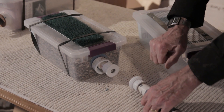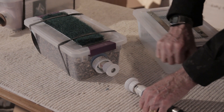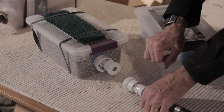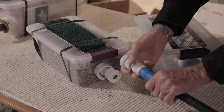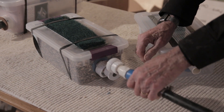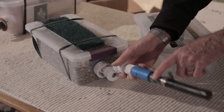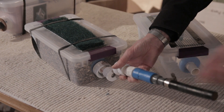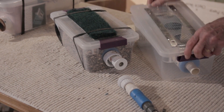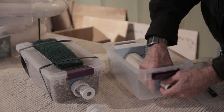For glue, use PVC plastic pipe cement — you can get that at Menards or Home Depot. It's good to have it break apart at the union here because this could hook up: this would be your foot valve and this would be your line going to your pump. So you can take it apart there, take this out, take this cover off, and dump the contents into a pail — all of this will come apart too.